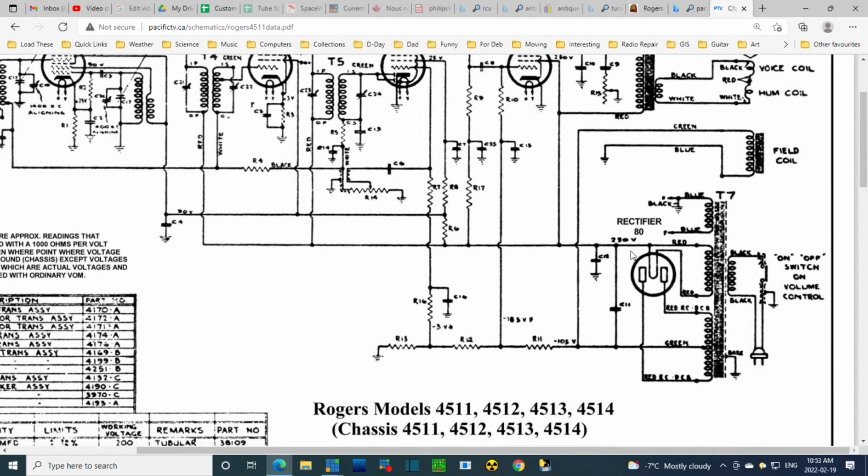For now, all we were really interested in was, did something go wrong here? Why is this radio humming so much? These are supposed to be 8, and in the radio they're 22. They're three times as big. Now, making an 8 microfarad capacitor was a big deal back in the day, which is why these are only 8s, not 10s, 12s, or 15s. They just get bigger and more expensive. Of course, the 22s that are in there are tiny compared to this. So, would putting big capacitors here cause the thing to hum? I can't imagine that.